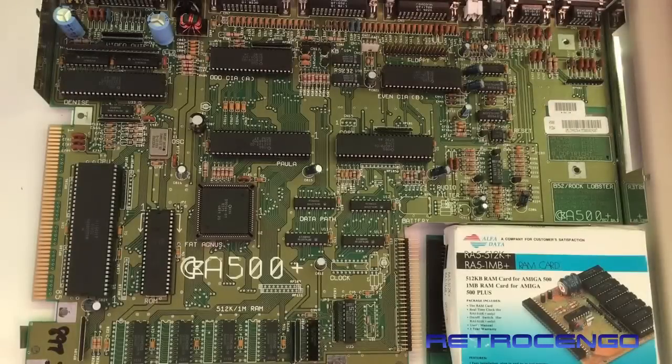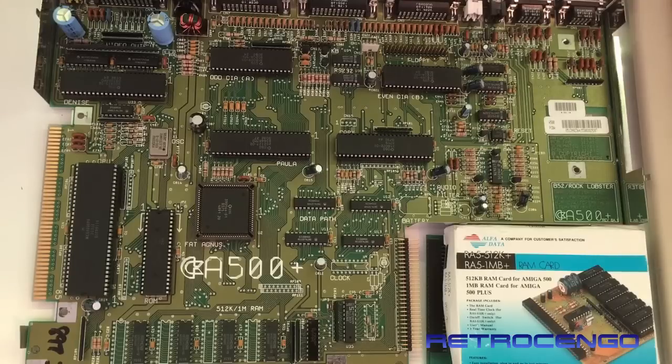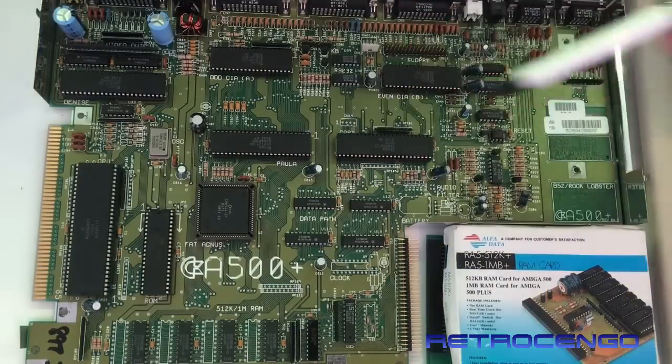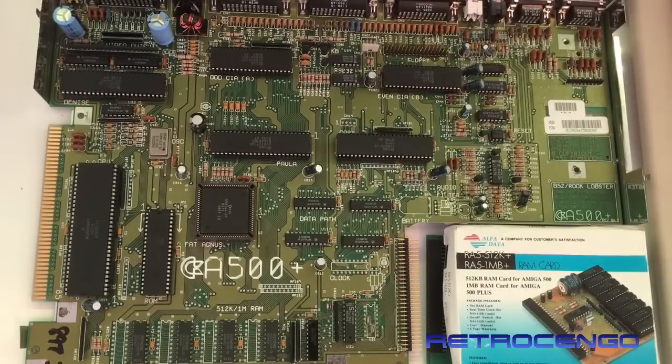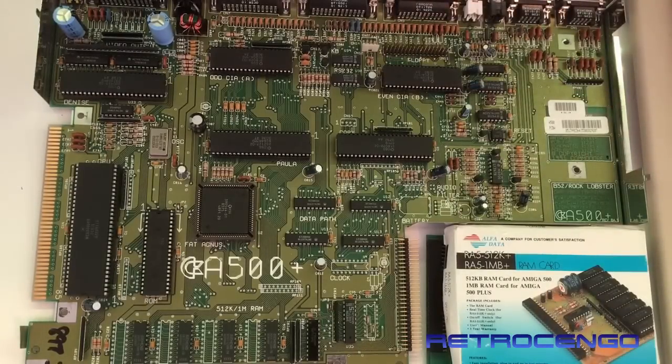Again, easy to fix. When I have disk drive problems that couldn't be fixed, or something with the keyboard, then it was just replacing these CIA chips. I mean, I haven't had any sound issues, never anything with Gary, nothing like that. Never a burned CPU, never. So easy to repair. And when you want to recap these Amiga 500s, 500 Plus, nothing is surface mount.